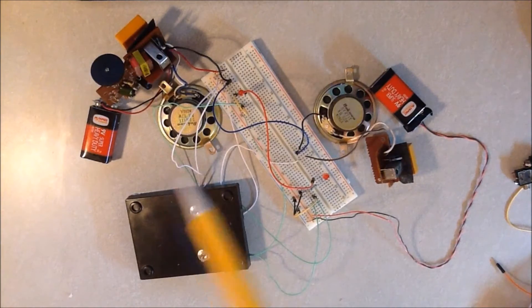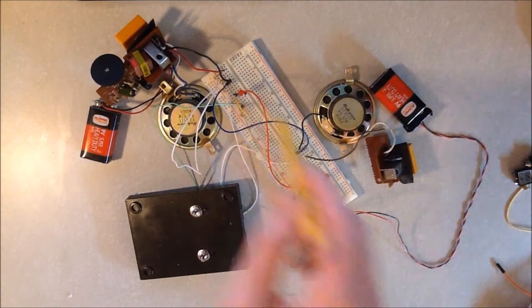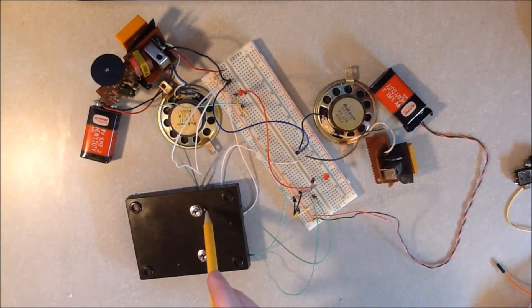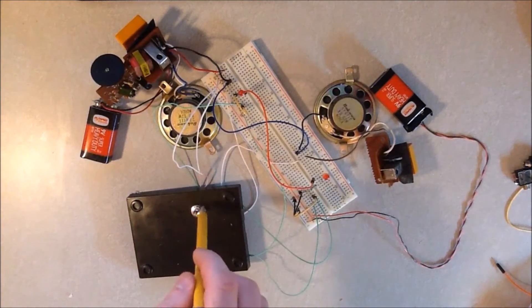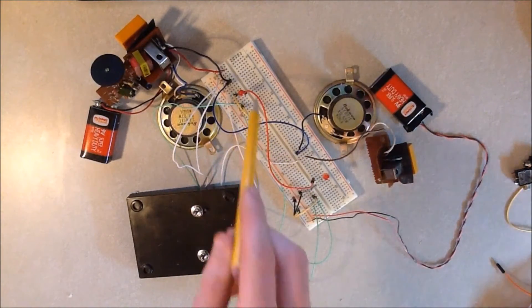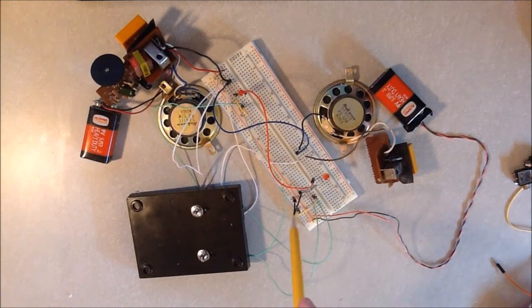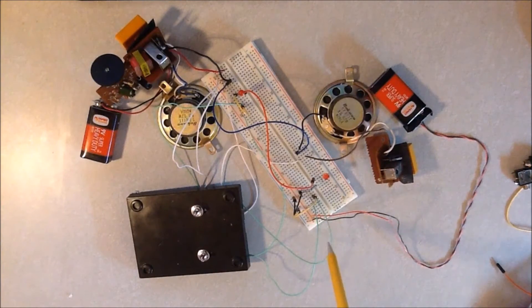As far as the green wires go, the switches are wired in parallel to each other, but the signals themselves are wired in series. This unit over here for this particular switch runs over here, and this one also runs over here - they're joined together at this yellow lead which connects to the LED. That runs over to a resistor, which connects to the positive end of the power supply. The negative end of the power supply connects to both switches, one running to each switch.